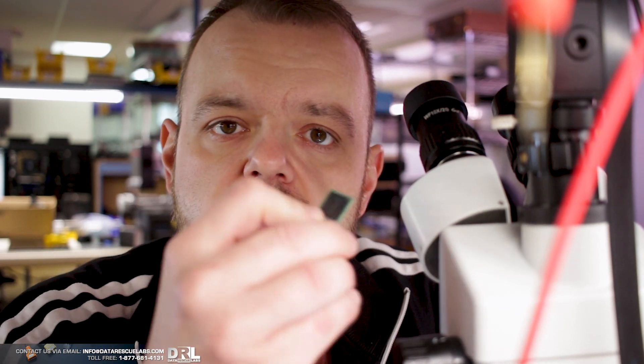I was going to fix it by just fixing the board itself, but the user is not sure whether the wallet is encrypted or the entire USB. I'm not sure if I'm going to risk damaging it further, because if the entire USB is encrypted we don't want to risk making this unrecoverable. So I have an identical donor which I'm going to use for the board itself - I'm going to swap the controller and the two NAND chips that are on here.